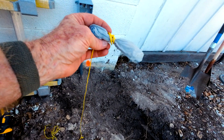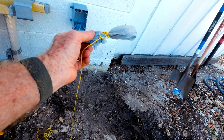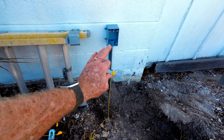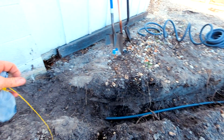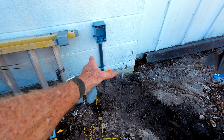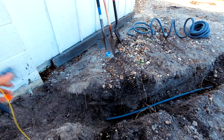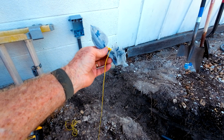On this end, I just took a shopping bag — actually one of the Lowe's bags I bought some electrical stuff in — and I've made up a mouse. You can buy these from electrical suppliers and they probably work better, but I've been doing this for a long time. Back in the late 90s and early 2000s, we were doing a lot of commercial work, remodeling for tech companies, putting in big four-inch conduit lines in trenches, deep for security. Weeks or months later, we'd come in and pull big shopping bags all the way through — hundreds of feet of four-inch with water in it. It amazed me how far a standard vacuum can pull this.